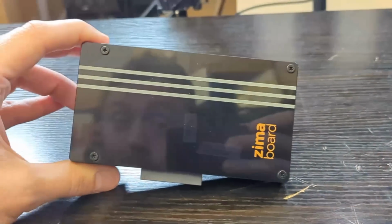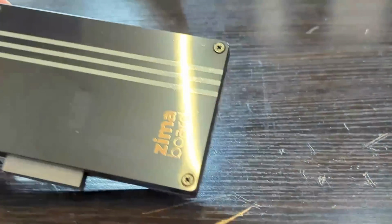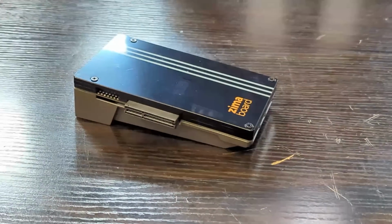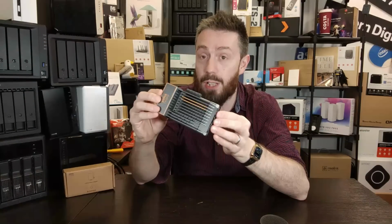If you are going to install this inside a pre-existing case, maybe you're going to use it with third-party software, you know, your pfSense, your OpenWRT, that sort of thing, or you're going to install it within an existing SATA cage to create a NAS system off the back of this within one larger unit, it means you're going to have to factor in active cooling around it the minute you encase it in something. This has been designed to work outside of any kind of enclosure.